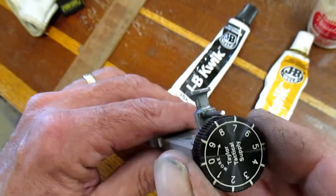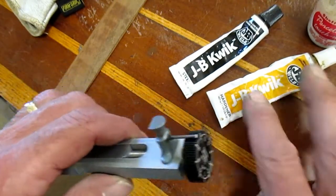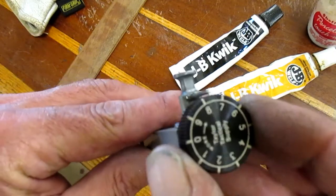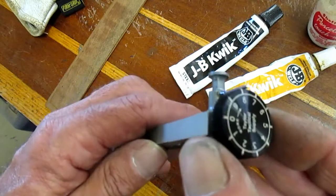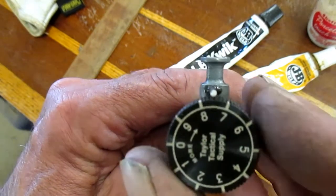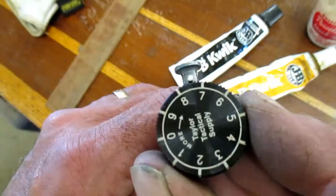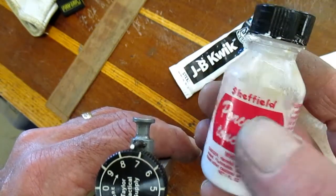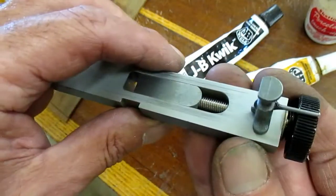I just epoxied in the rod. This stuff's good — if you don't need full strength, they have JB Weld quick set that sets up in about 15 minutes, so for something like this I just put a little dab of that. So much for perfect center — I couldn't believe the wobble on that bit until I actually watched the video. I guess I need a new bit; that thing is pretty dull. Anyway, there's the effect — now you can see I have a reference point. I put a little dab of white lacquer on there — Sheffield touch-up paint — I use that to touch up white dots on my sights too. I think that'll work out nicely.